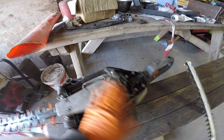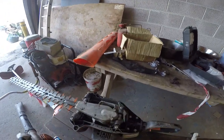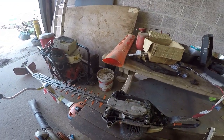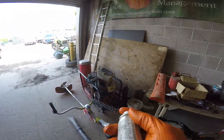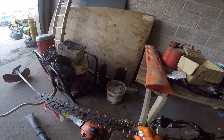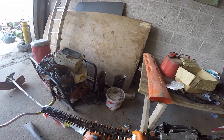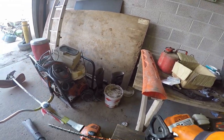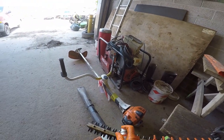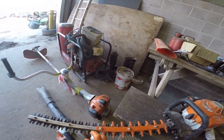So to maintain them on site, you need one of those, and one of those, they also come in a big one. And this is basically the pocket size version. Stihl do this, so you can carry it in your pocket and you can maintain it during the working day simply by doing that, little and often. And you turn it over and you do the top, especially the toe of the bar, which does quite a lot of work.